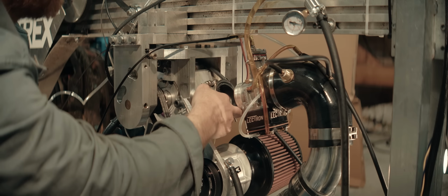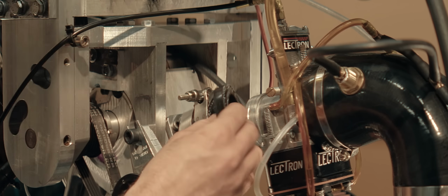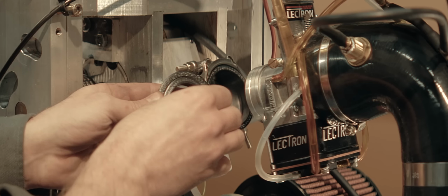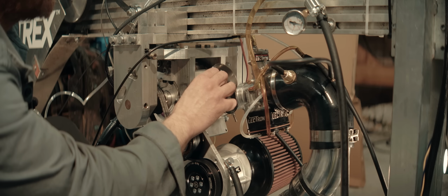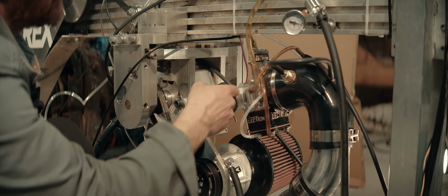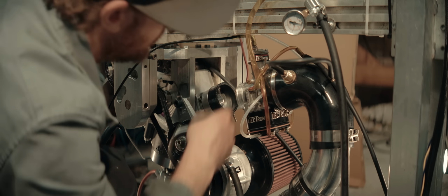I pulled the carb to inspect my sliding reed valve. It's fine. These silicone packing pieces I made though, they were really swollen. Might be this inner piece was interfering with flow. And at least the swelling was maybe causing some more puddling here than before. Maybe. I think I'll just ditch this fat clamp, make this shorter so this can sit flush. Should 3D print something or something else, but a less fat clamp is the obvious solution. Just get the carb closer.